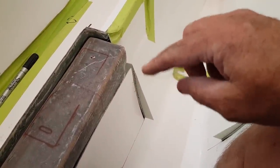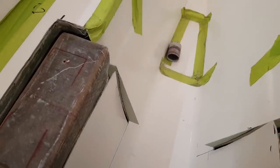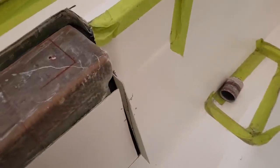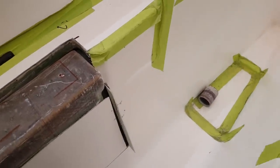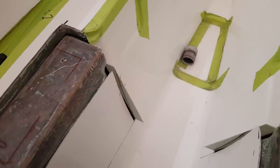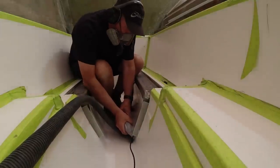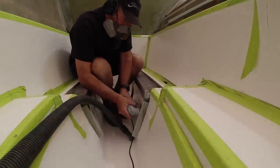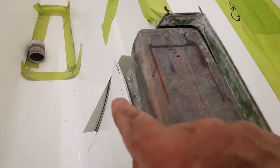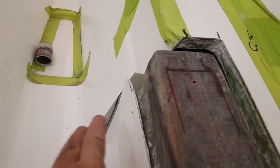I'm going to do a complete cosmetic repair on all of these sections — all four on the stern — and basically build this up to the point that it looks like it was never chopped up. It probably will never look perfect but it's going to look a damn sight better. I've drawn a line there, I'll get my multi-tool and trim off that fin, then add another piece underneath this flap which gets glued to the foam bolster.